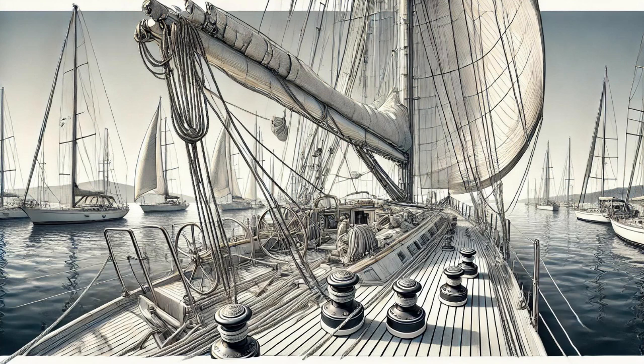Don't forget those tiny little safety pins. You'll find them on most turnbuckles, and they prevent the turnbuckle from loosening accidentally. Wait, safety pins, like the kind you use on a diaper bag? Yep, those ones. They might seem insignificant, but a missing safety pin is a major red flag. It suggests negligence and a lack of understanding of how crucial these small components are.